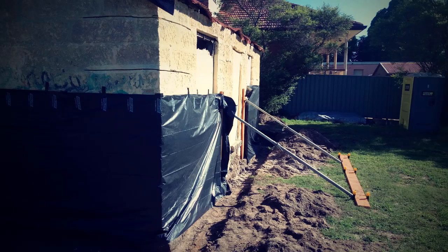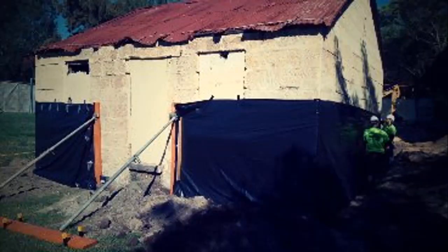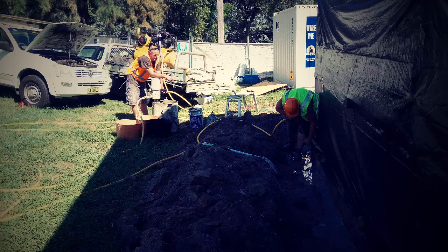On the outside, we covered up the walls with plastic. We cut joints where we're going to put the helical bars to hold the walls together. On the ground, there's a small trench dug out for any puddling of the grout. You can see the puddle left as we go along — injecting about every 100mm.